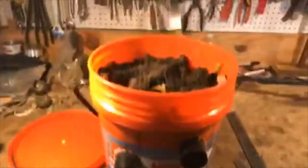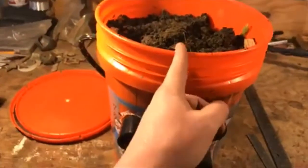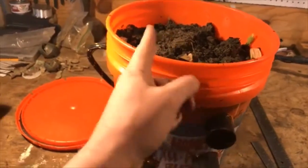So on that mark, drop your plumb bob down, and that's what I did, and I made a line. That's going to be the center mark, and then drop one here. Same thing on all 4 sides. Again, like I said, 6 inches in the center, because it's a 12-inch wide bucket. Outside, you can make a mark here if you want to, but you're going to come over 2.5 inches for the center line of where you're going to drill.